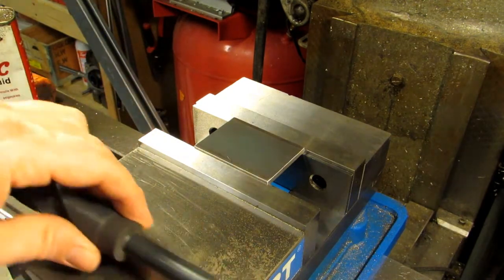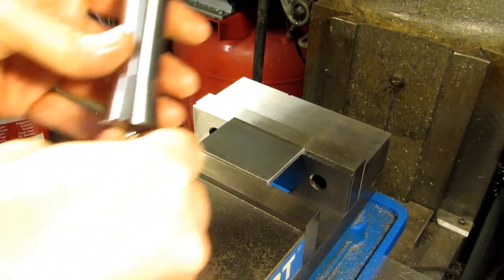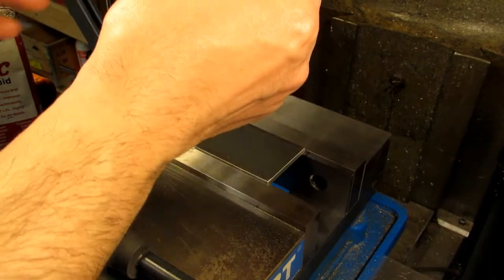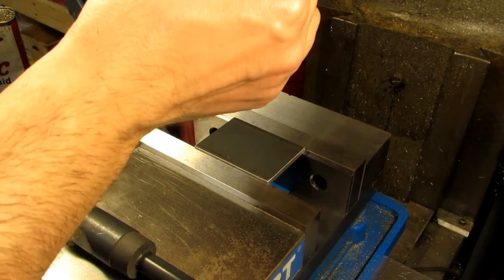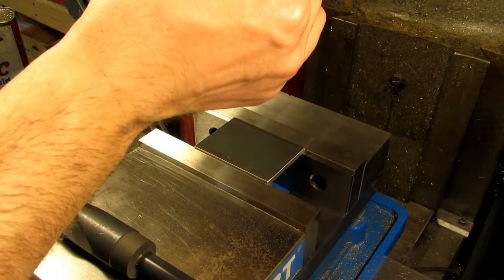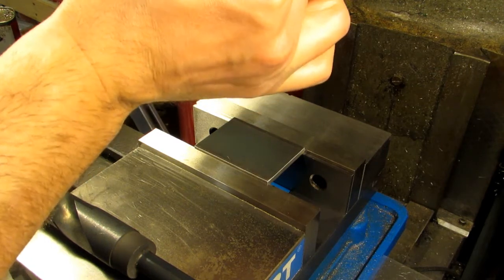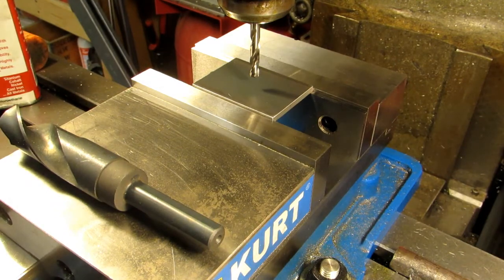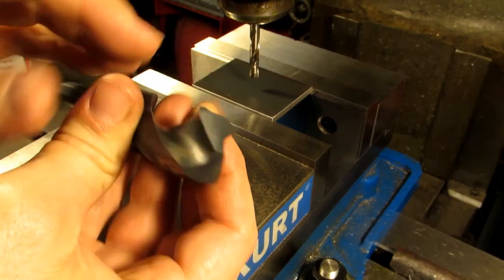So let's go ahead and drill a hole. I'm holding both of these in a collet. You could put the quarter-inch one in a drill chuck, but I don't want to keep raising and lowering my table to get the drills in and out since they're so different in length. Here's my quarter-inch drill — this is just a pilot hole that will be bigger than the chisel point on the larger drill.